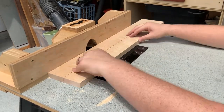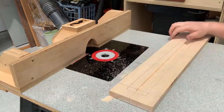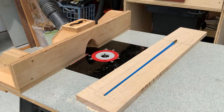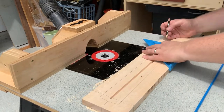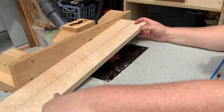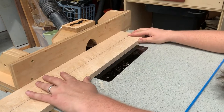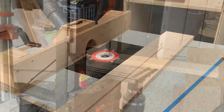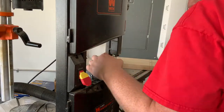And on that last one, I used the truss rod itself there to figure out how high the bit needs to go. And that little end bit with the adjuster nut is a little bit bigger, and so I'm taking the time to route that just a little bit deeper. And then off camera, I clean it up with a chisel.